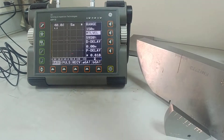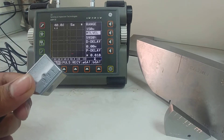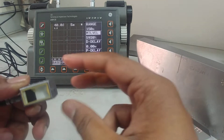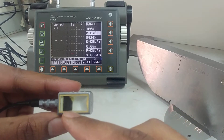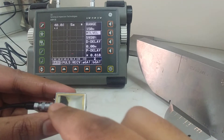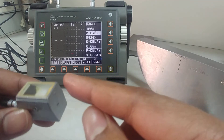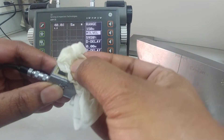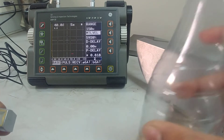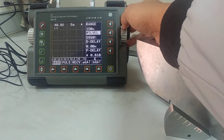The material velocity — we are using this probe which uses shear waves. If you look carefully inside you can see the black area, that's your actual transducer, and the white glassy area is the plexiglass wedge. On the right side there is something for diffusing or reflecting the sound wave. Let me clean this one. We also need oil as couplant.